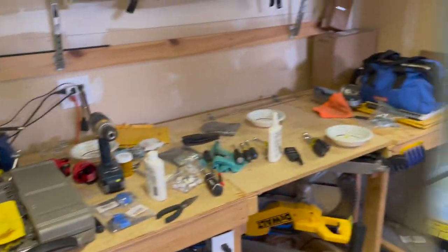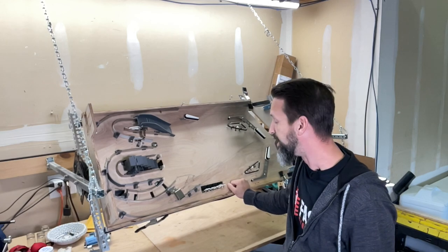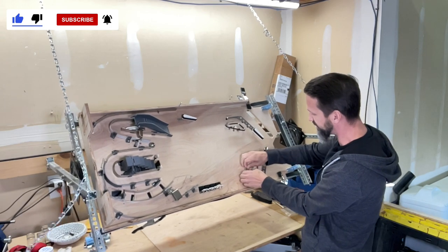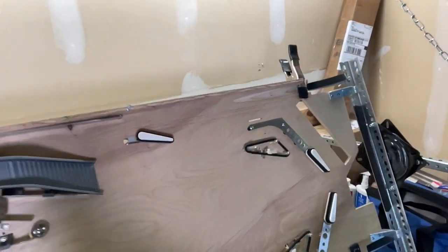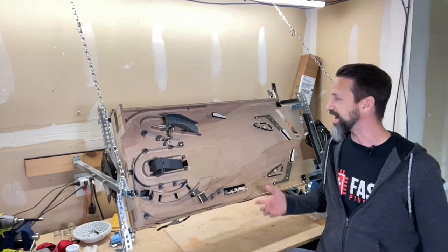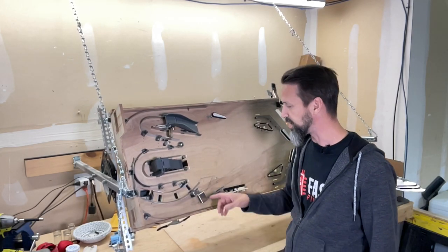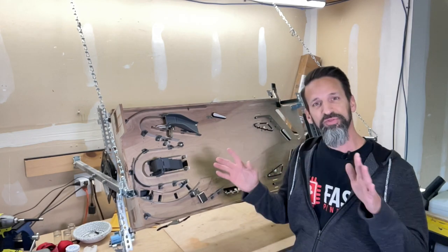All righty. Today we've made a lot of progress. We've cut a lot of holes in this piece of wood, a little bit roughly, to go through and get our shots going. We had this nice CNC lower playfield - things look nice and crisp, good cuts. We've iterated a little bit. Remember this flipper over here? We've ended up moving that probably close to two inches. The scoop ended up getting moved, this hole for the subway is not quite where it needs to be, and all these shots are pretty rough. These drop targets - if you look, these are not equally spaced; there's a little bit bigger gap in the back one, in the middle. It's time to go through and clean all that up.